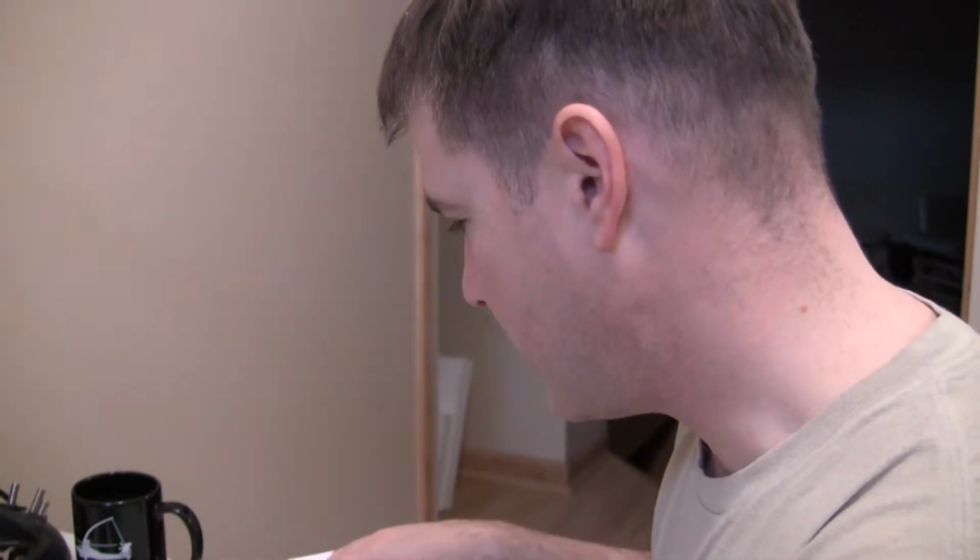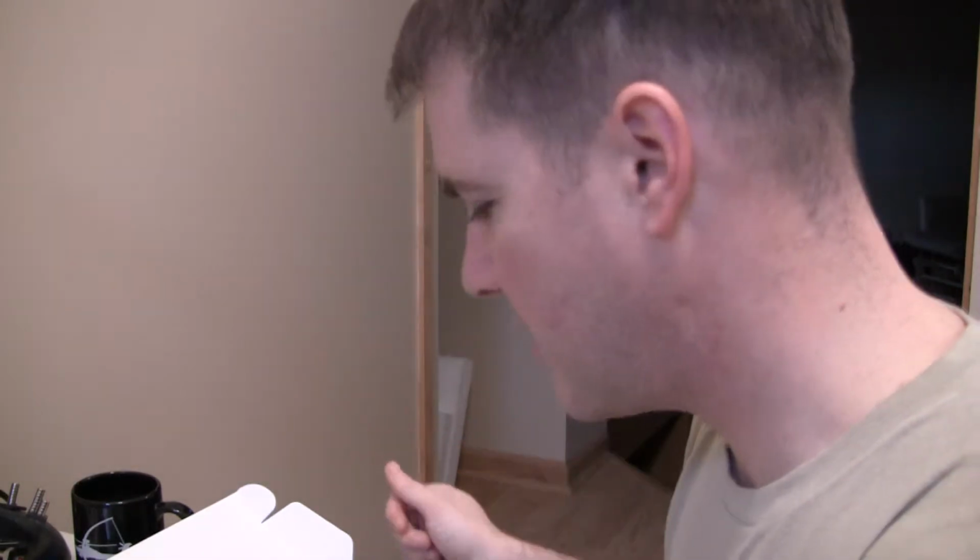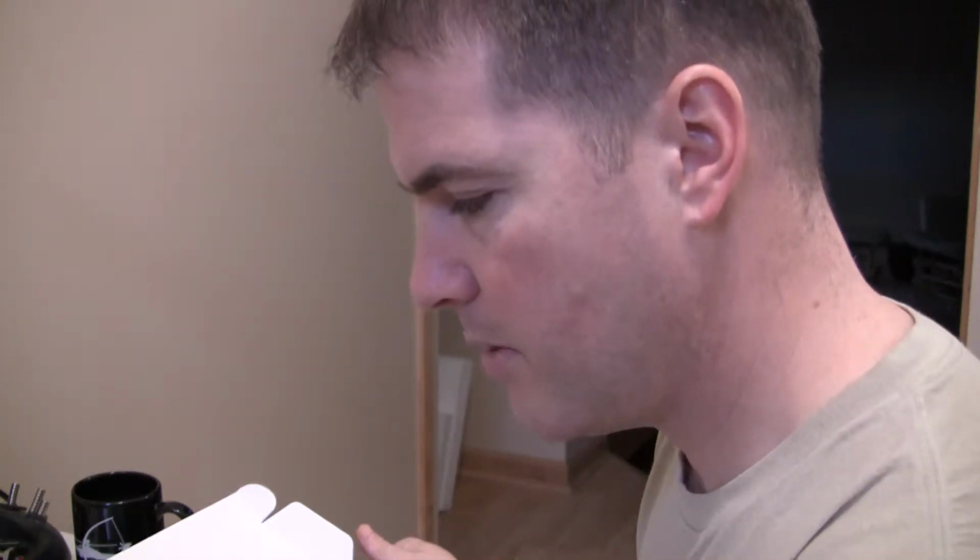Anyways, this is the Powerbox 3-axis gyro system. It's the full version. They've got a new version, like a light version, but I went with the full version just because it has the GPS function in it, and I thought that would be pretty cool for a jet like the Avanti that has such a wide speed range. So you automatically get gain adjustments. I've heard people say that there are some issues downstream, when it's coming straight down, but how often are you pointed straight down? Now pointing up is another thing. If you're doing some high alpha stuff and you're trying to hover the jet and it starts affecting your gyros, that could be an issue. But probably not enough to notice, or they would have addressed it or something.